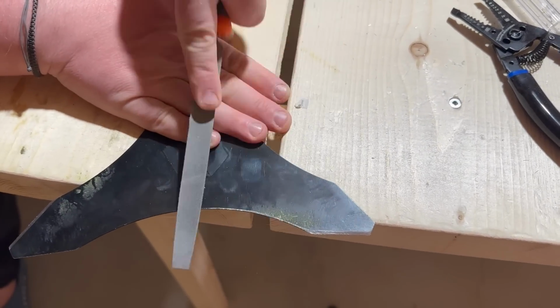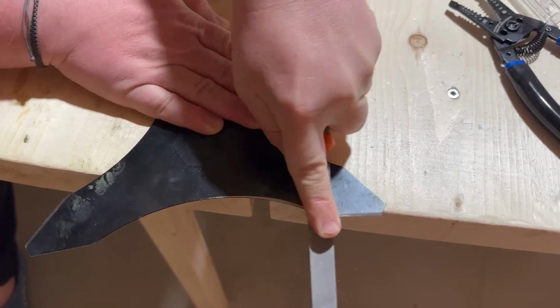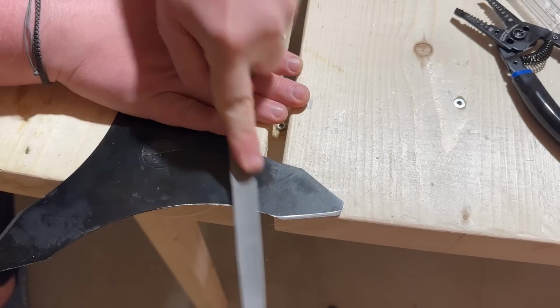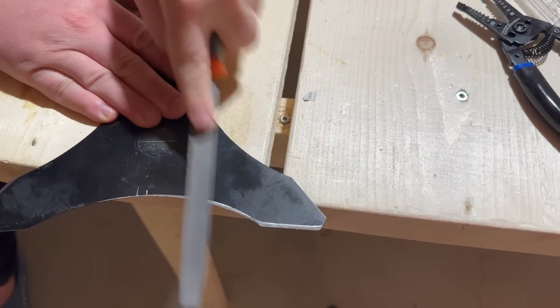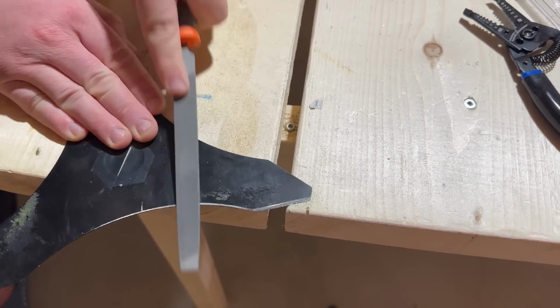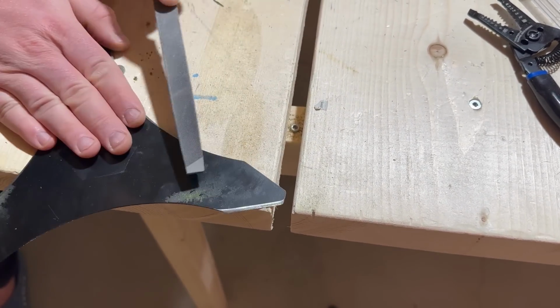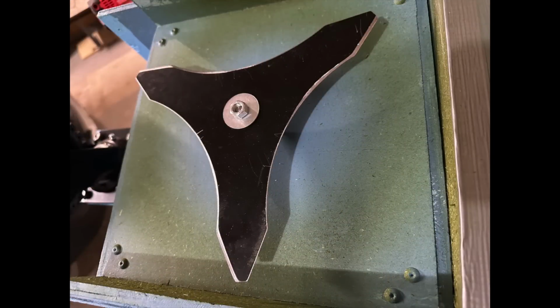And the last improvement for this video is blades. To be honest, the electric motor is too weak to cut tall grass. It gets stuck and the motor overheats and it doesn't work as intended. Luckily, I can replace my previous blades with a solid option, and I'm sharpening them as much as possible. The result looks aggressive, and that's awesome.